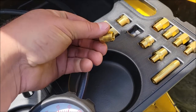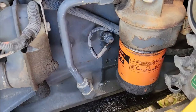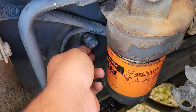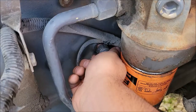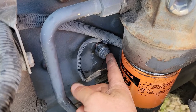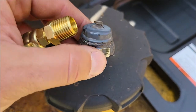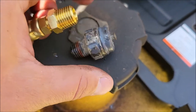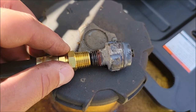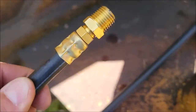I'll put a link in the description to a comparable one. Once you have the kit, find the correct fitting — I've already tested and found the one I need. This fitting goes on the end of the other fitting and then you just screw it into the engine. To remove the sensor, just unhook the wire — mine slides right off. I used a 15/16 socket to break it loose, and then it unscrewed easily by hand. Here's my sensor — it looks like it may be the original. You can hold it next to the fittings to guess the size you need.